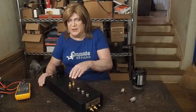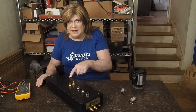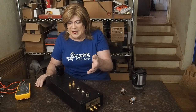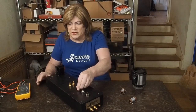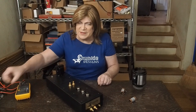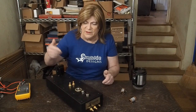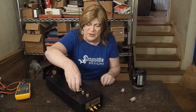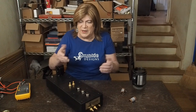The other difference with the new one is I brought the indicator light from the board up through the top of the chassis — I show how to do that in the build video, and if I ever build any more of these that's definitely how I'm going to do it. This little Hammond transformer and the switch — that's all nice. I like the way the tubes just barely stick up. I've got some of these little curtain rod grommets; I want to try to find some solid brass ones because these gold-colored ones don't really look that great. These aren't something I would permanently attach, because then you wouldn't be able to change the tubes out without taking the preamp apart. The way it's built right now, there's just enough tube sticking up to swap them out.